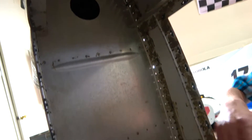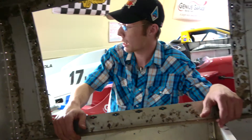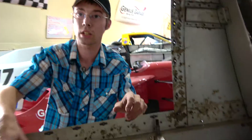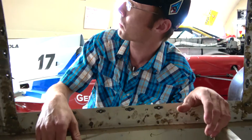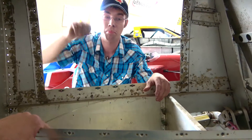Most of this stuff was done before I got to it. This hole up here is where the jack shaft would go through if it was a propeller version. Now do you know if with a jet in here that hole would be made larger? I'm not entirely sure — I believe the jet version might have slightly different ducting. It has big NACA ducts on the front, so that might have been larger, and then something to get the exhaust out without burning anything.